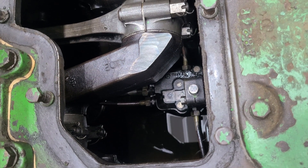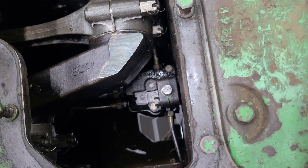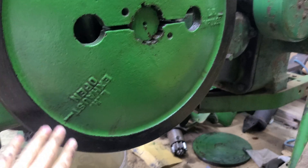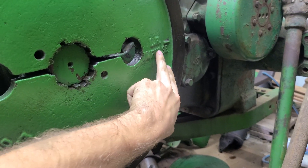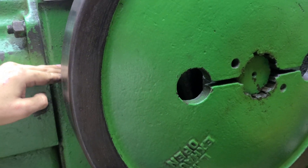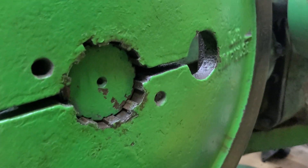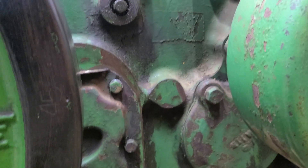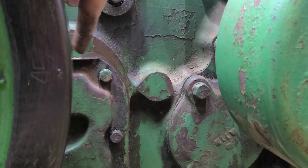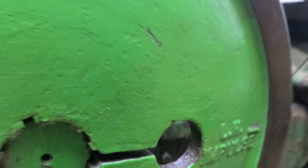After lining up the crankshaft and camshaft gears, you rotate the crankshaft so number one cylinder is at top dead center. For the flywheel, there are typically two markings: left-hand impulse and left-hand exhaust open. When you install the flywheel with the crankshaft at number one top dead center, you want the left-hand impulse marking at the three o'clock position. On this tractor there's a dot that lines up with a flange on the cover; on others you'll see a notch or groove in the cover to indicate that position.